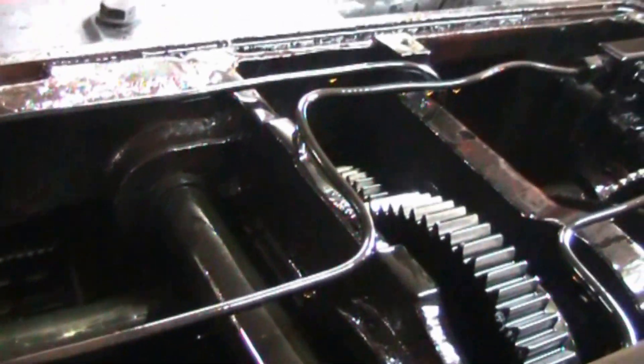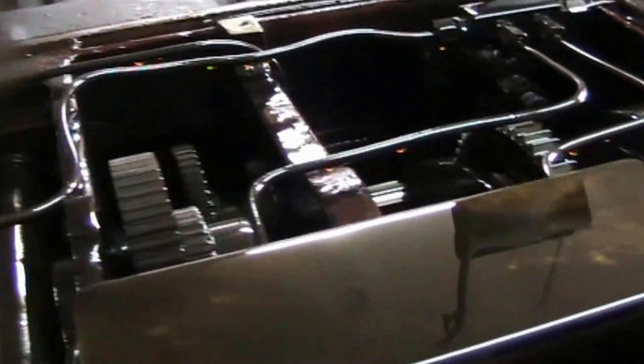There's still a little bit of mist coming up off the clutches down there — the clutches are way down in the bottom and can't be seen from here — but the oil both cools and lubricates the clutch. I have a suspicion that this machine was run without oil for a long time. I'm the first guy in 30 years to look after this poor old thing, so it's hard to say what kind of wear is on the lower end. We just re-motorized it a year ago, so that's where we're at.